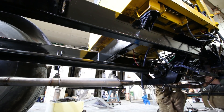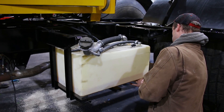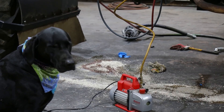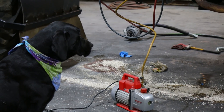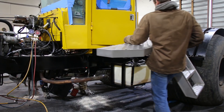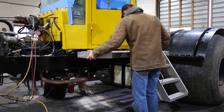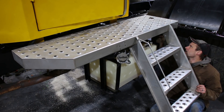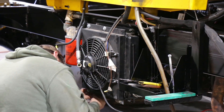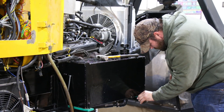The Dans worked on getting the exhaust bolted back on, and I worked on installing the fuel tank, which we actually bought from a marine supply shop since it was quite a bit cheaper than the other options we were looking at. Drake pulled a vacuum on the AC and recharged the system. The cab also came with a really nice stainless step, which we were excited to be able to make work. I got that bolted back on the brackets I made that supported it and the fuel tank underneath it. Dan plumbed in the hydraulic oil cooler and tank. He also contributed $5 to the paint chip jar.